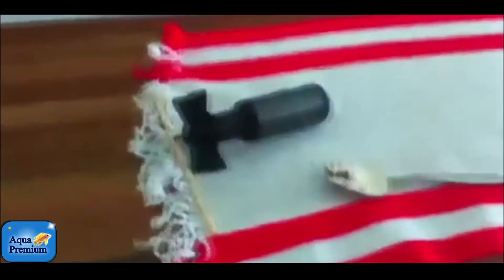Number one is that it's really important that you clean out your impellers. We've got a nice big pump here and the impeller was absolutely putridly dirty. Every three to six months just pull the impeller out, give it a bit of a clean, and put it back in the housing to make sure your water flow stays good.